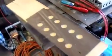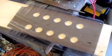The first thing I've selected for my actual mount is a piece of perspex. I've selected perspex because it's easy to mould with a little bit of heat, as opposed to polycarbonate, which is damn near impossible to bend. The heart of a holder is basically this leftover piece of perspex from a previous project.